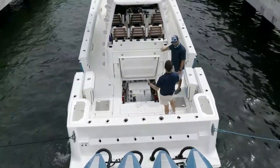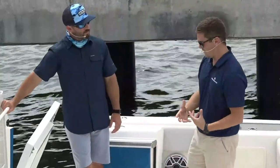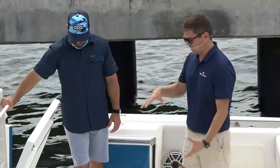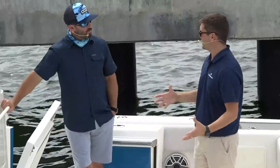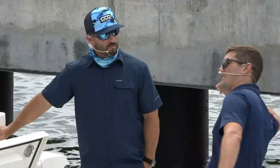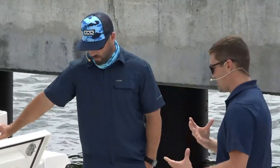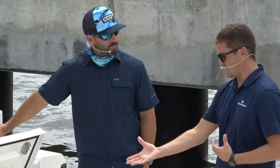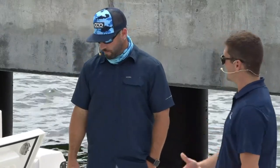Now, once you get those flywheels spinning at that speed, you've got to keep the system cool the entire time. So what we did is our inventors put it inside of a vacuum and created a frictionless environment inside. We kind of equate it to throwing a rock in space. Once you create that energy to get that rock going, it's just going to keep on going at that same speed. So a lot of the energy that the unit uses is at the beginning, at the spool up, just to get it started.